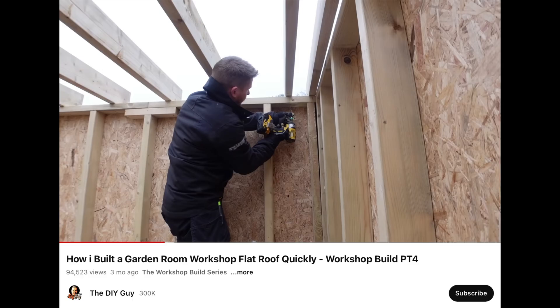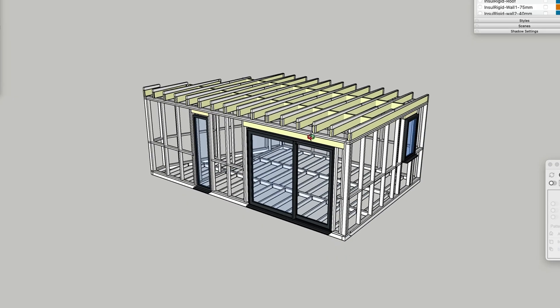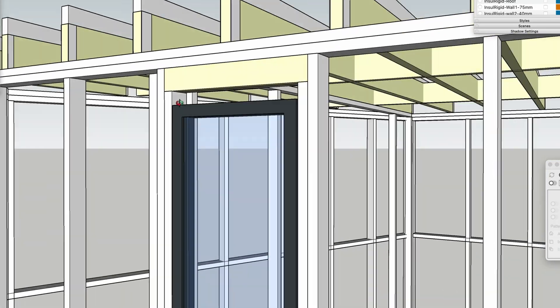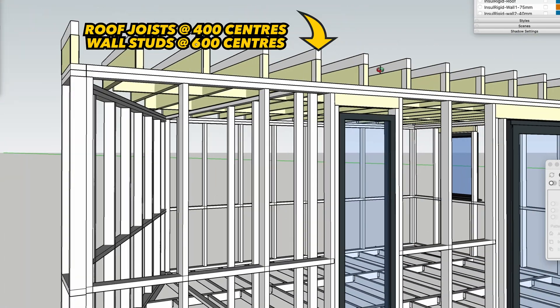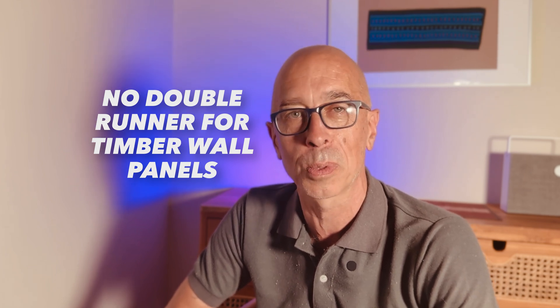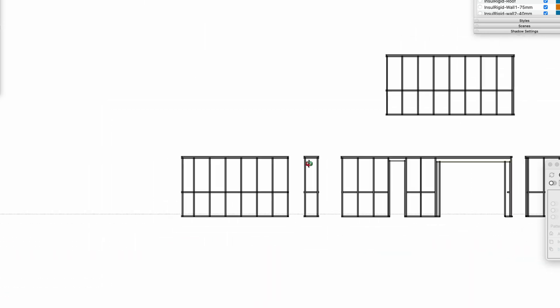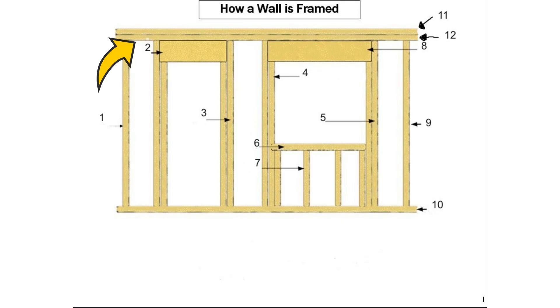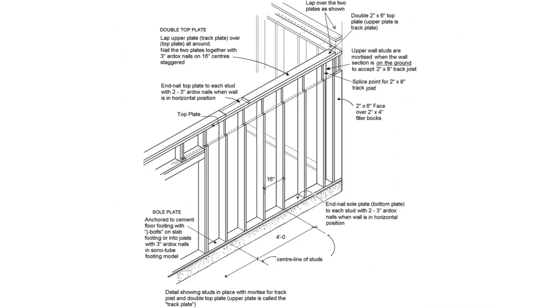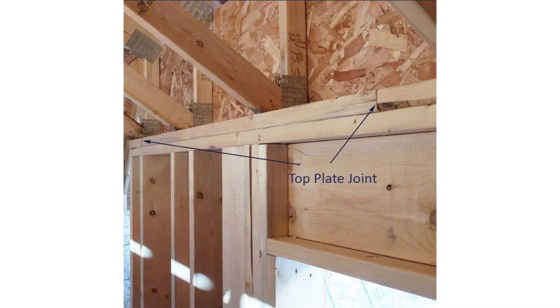Make sure that you leave movement joints and gaps in your sheets and make sure your builder has that in hand. It will manifest in cracks in your plaster, flooring buckling up, and windows and doors not working right. Now, timber frame again — the top rail not doubled up. These things cost nothing. Loadings need to account for nine inches of snow; roof joists are often at different centres than wall studs, so you get different point loading. Doubling up the top rail has come about through centuries of timber frame stick construction evolution by master builders.